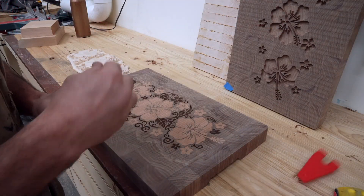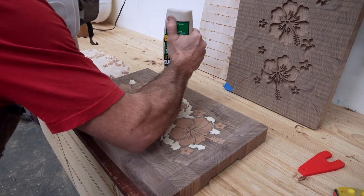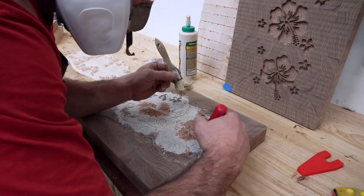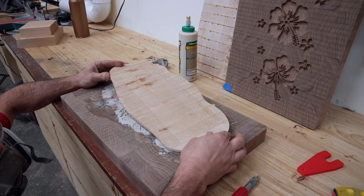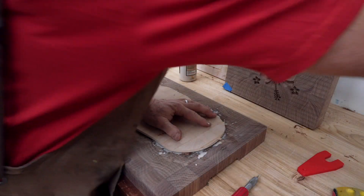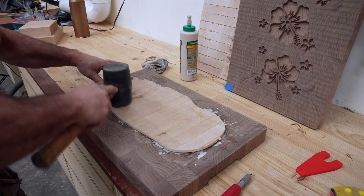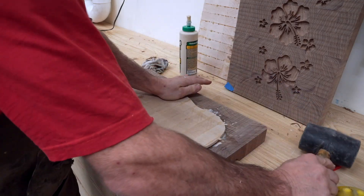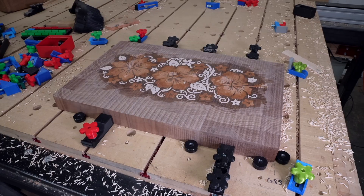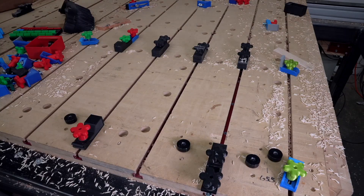Autodesk Fusion versus Vectric VCarve for doing VCarve inlays. Vectric VCarve is a great program for doing what its namesake says — VCarvings and inlays with it work really, really well. They've been refining this process for a long time. A huge advantage that Vectric VCarve has over Fusion is that you can manipulate the vectors inside the program. It has ways to easily round over all sharp corners, easily add boundaries around a particular vector area, and find out problems if your vectors have issues like overlapping or zero-length spans. So it's a really good program for those top operations and actually editing the vectors inside of it.